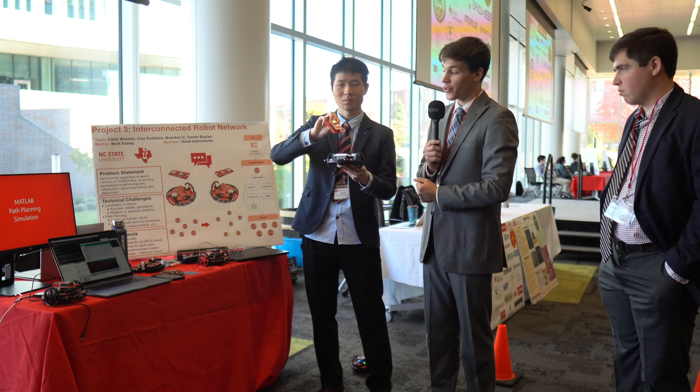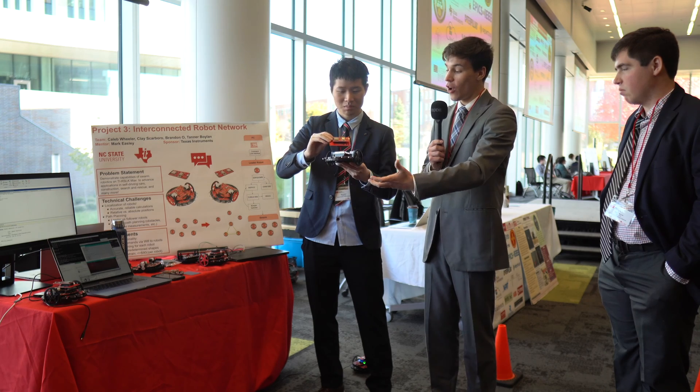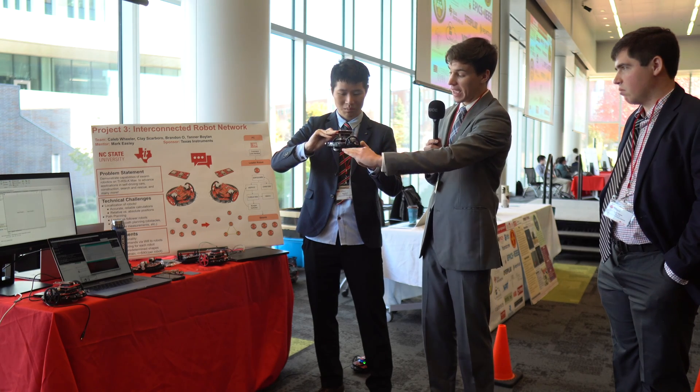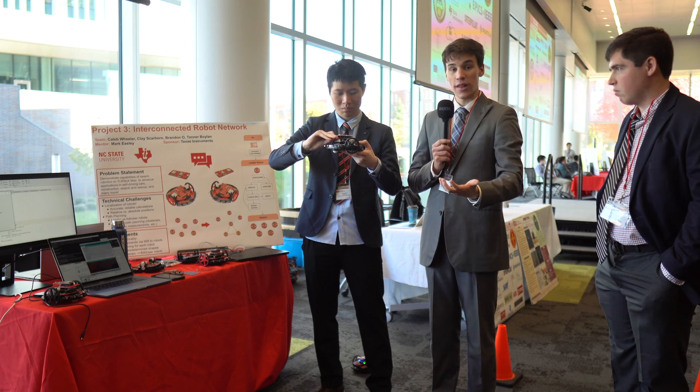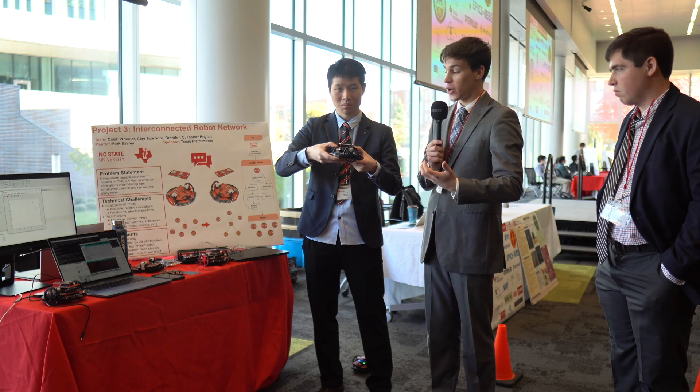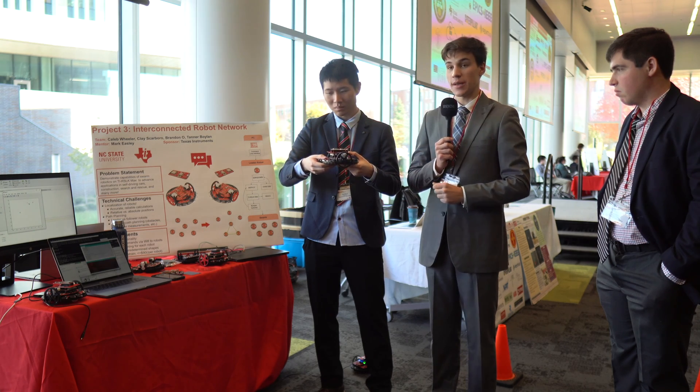The Maker Fab UWB module contains the ESP 32 for Wi-Fi communication and the DWM 1000 ultra-wideband module that determines the robot's distance from the anchors to calculate its two-dimensional location. It was great to see all these pieces working together — C at the mechanical layer, C++ one level up, and Python on the computer — integrating across all our subsystems.